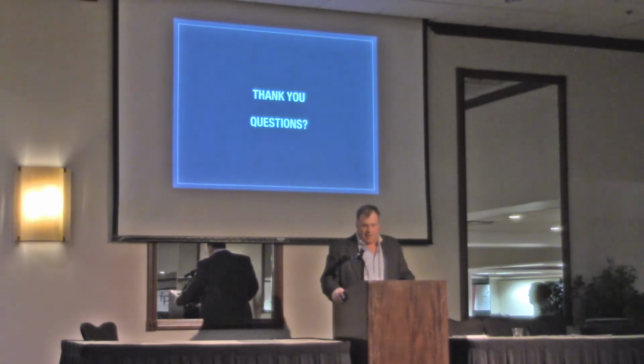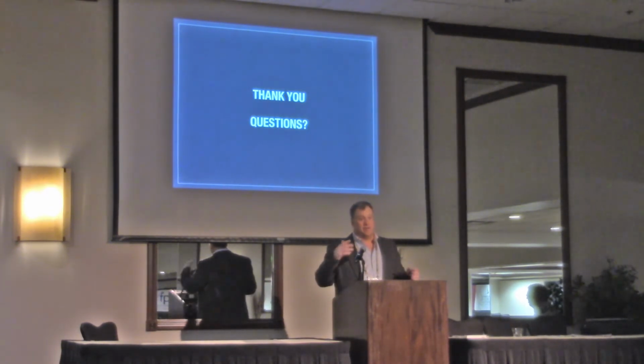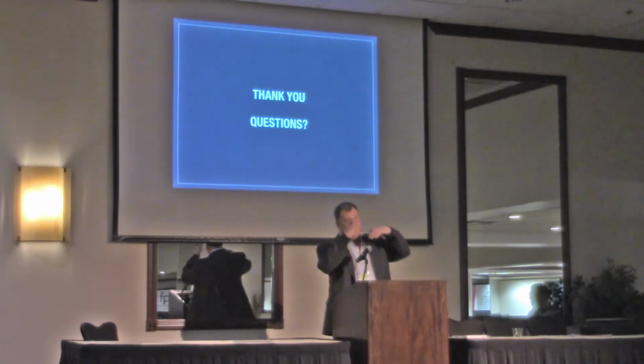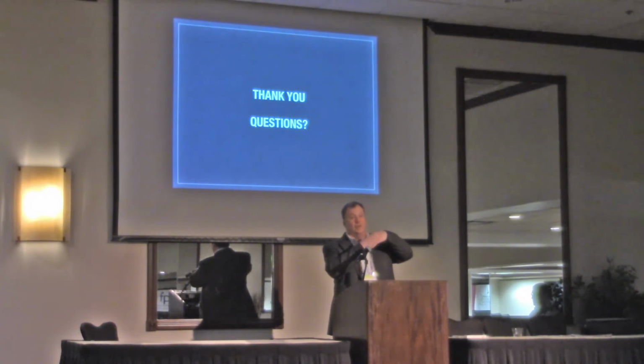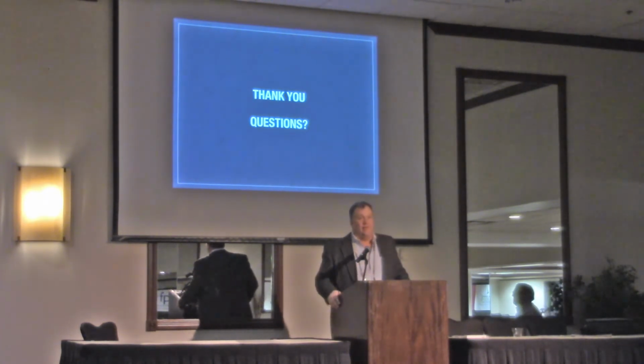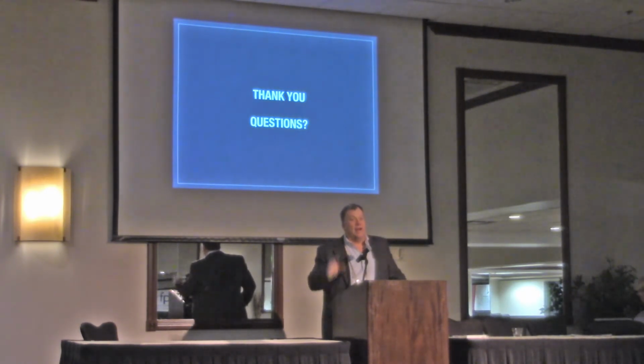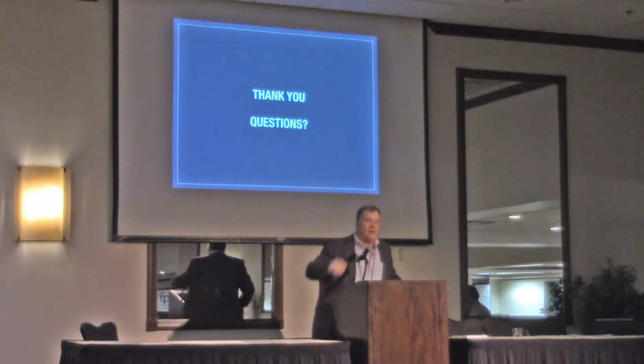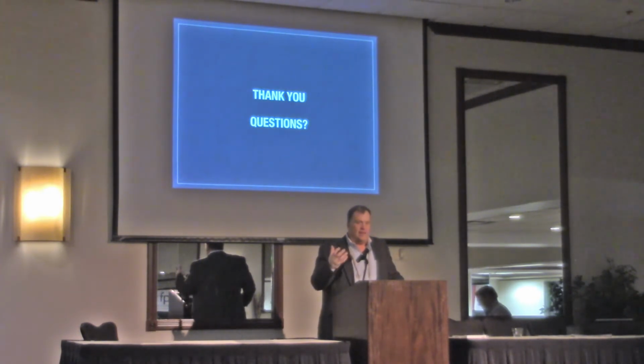I think when horses are laminitic and they founder or sink, that determines your blood flow to start with. But I'm going to search for the inside of that white line. That's what I'm going to search for. When I say the white line, not the outside, especially on a laminitic horse, it's going to stretch. And when it stretches, I've got to find the inside. That's the point where I want to fit. I want my dorsal wall to be in line with my coffin bone, but I don't back up laminitic horses that much. And we work on quite a few. Back up per se, we might chop that much rotated capsule off. But I put them where I think it's supposed to be, right under the hairline, right under the coronary.